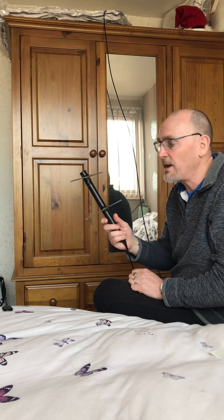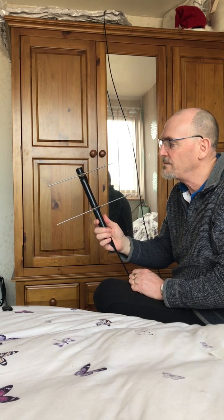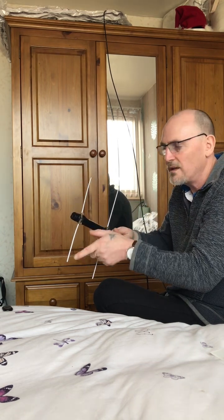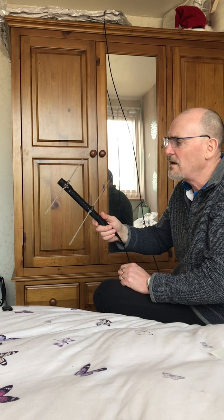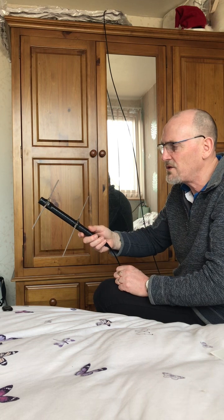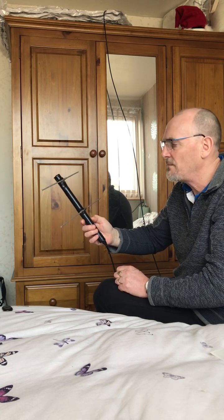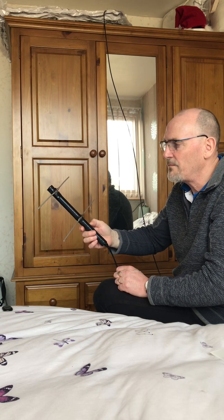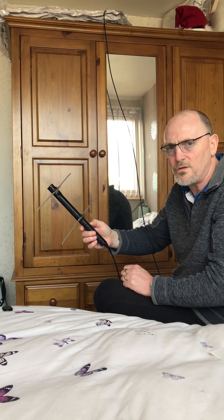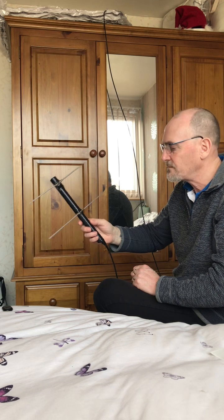I hope you've enjoyed my quick talk on the Yagi antenna and the dipole. You do see these around. There's a company at the moment that sells just dipoles for the 4 meter band, I think, which is 70 megahertz. This Yagi has been trimmed and made for the 433 megahertz band. 2 elements was just enough to do what I needed it to do, which was local work on FM.